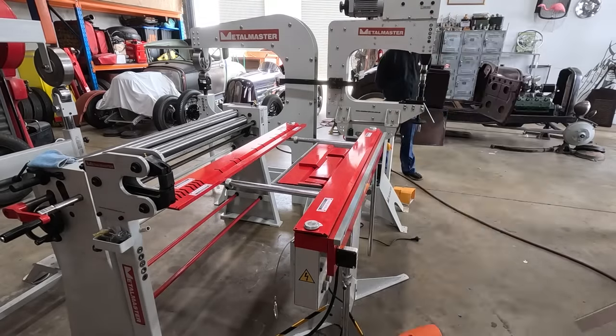Right before the meet and greet, I was working on using the bead roller to tip the flange, and then I was trying to control the amount of wave that I showed you in this panel, because we linear stretched this to get this curve. I was shrinking and I shrank a little bit too much on the flange trying to control it. I can actually see it and feel it right here that we took some of our linear stretch rate out of it. So I'm gonna have to try and get that back.